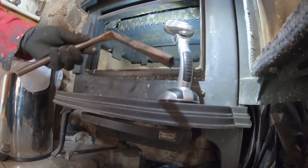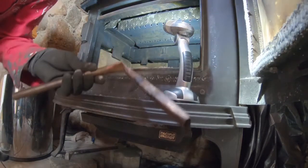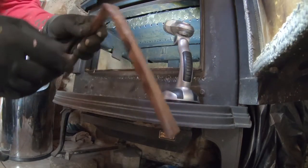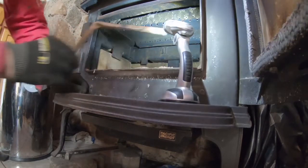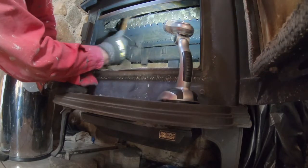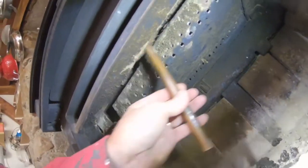So what I did was I came up with a little idea with a tool. I took a piece of copper pipe, modified it — put a bend in it and flattened it out. With that little tool, I can get it up and over the top of the baffle, and by turning it, I can get that soot away from the baffle so that it can draft properly.